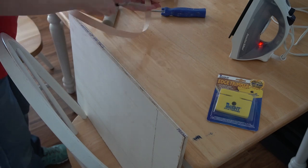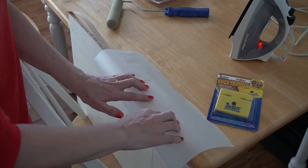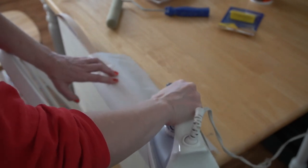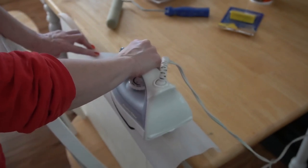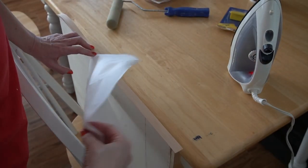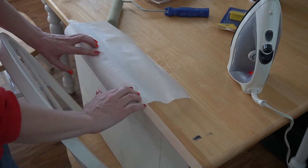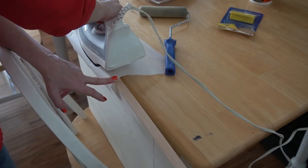The plywood shelf had an exposed raw edge so I used some edge banding to cover it — yet another thing I'd never done before, because why not do all the things at this point! This stuff is super easy: it's a thin glue-backed wood veneer that adheres through heat. I used parchment paper between a household iron and the banding, and it attached no problem. At least my iron finally got some use — I couldn't tell you the last time I ironed clothes. I let it cool completely and trimmed the edges with an X-Acto knife off camera.